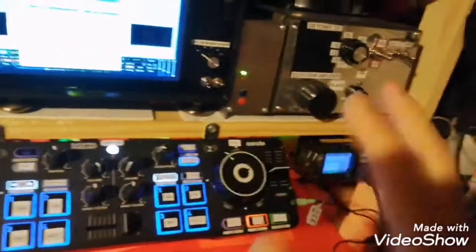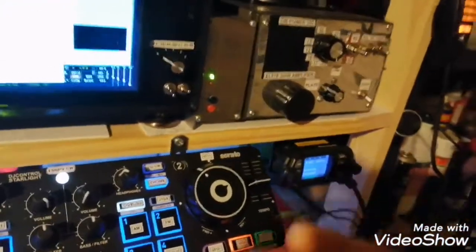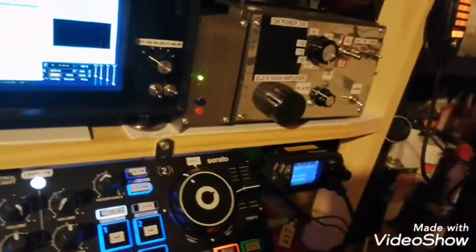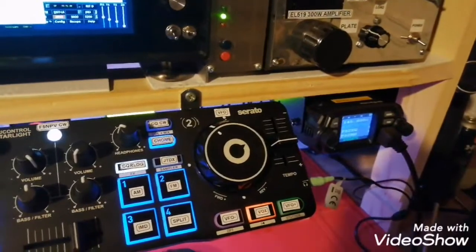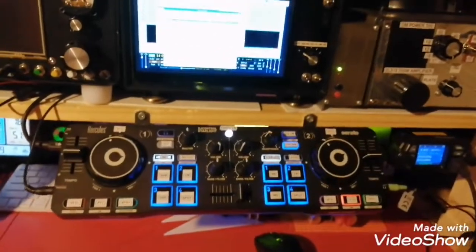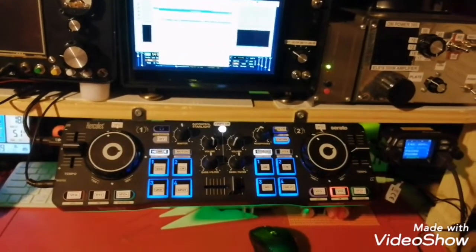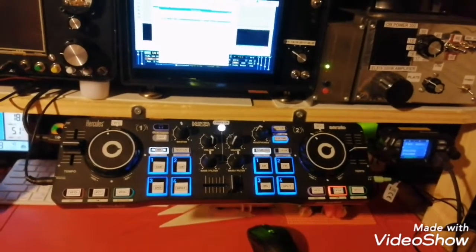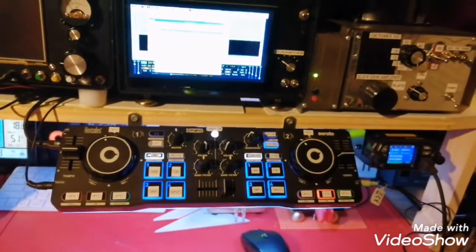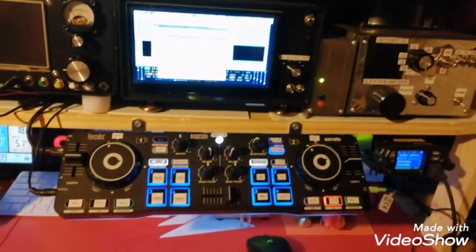I also use a jog wheel to control my rotator — mapped with a little xdotool script that sends RS-232 commands to control the antenna rotator. 73, have a nice weekend and a good day. Hopefully you'll be successful integrating a MIDI controller with Quisk on your SDR — Hermes Lite or RS HF IQ OB PCB SDR transceiver. 73, this is Foxtrot 5 November Papa Victor, QRT — bye bye!